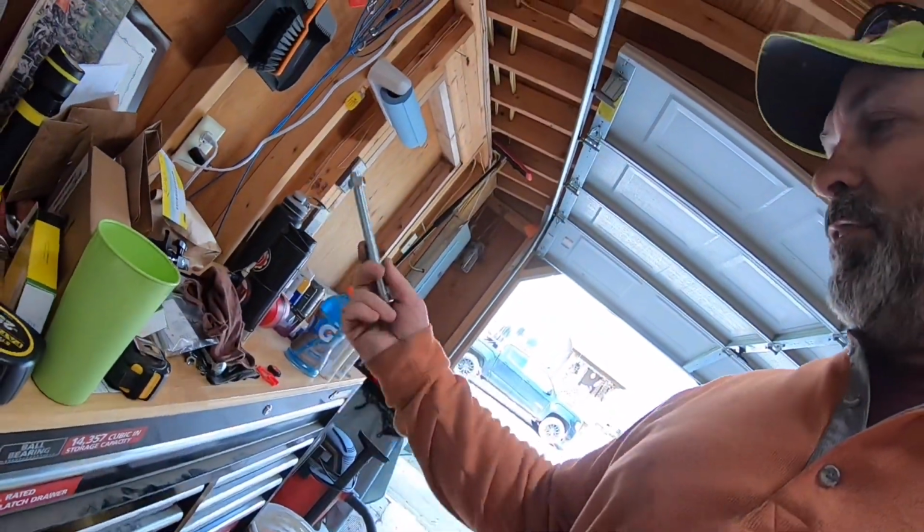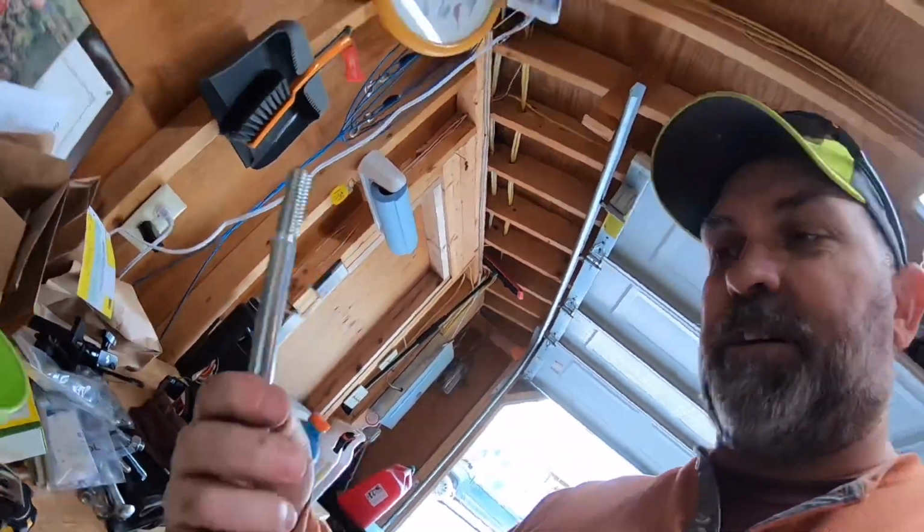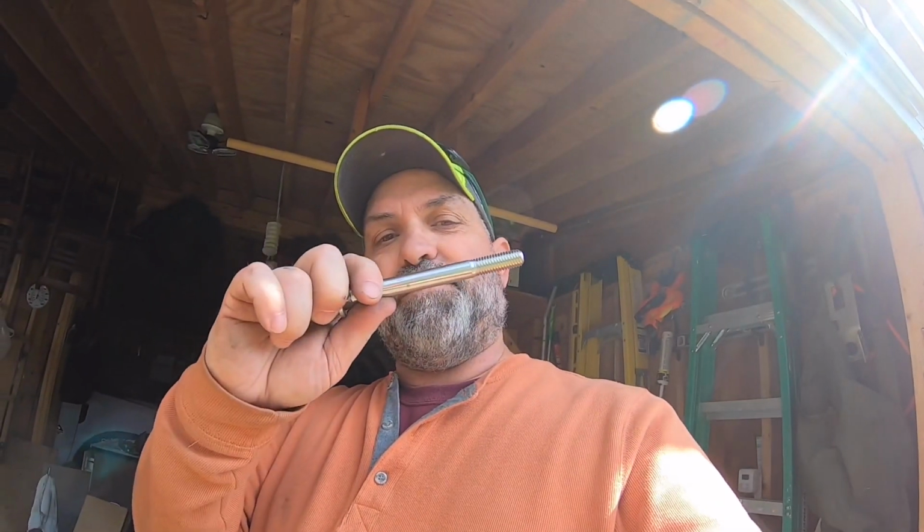It did work. Now, tip number 2, and I know this has been said several times. The bolts that come with it, it comes with a set of 3.5 inch by 7/16, probably, knowing John Deere, it's 11 or 12 millimeter, and then it comes with these to mount the second set on. Now these are only a 5 inch. One, 5 inches too short. Two, this is a bigger bolt and it will not fit through the holes on the weight. So I'm waiting on the bolts. They should be here today or tomorrow, FedEx.